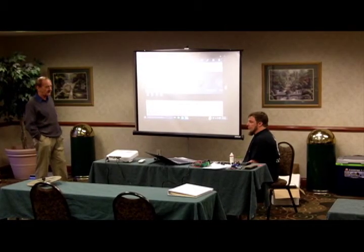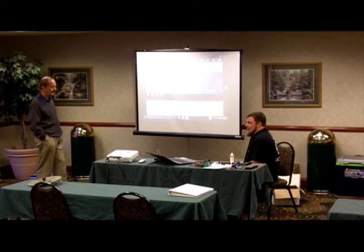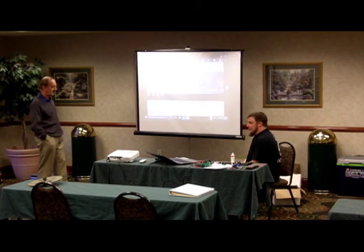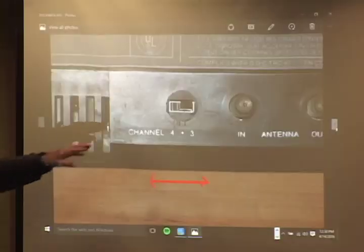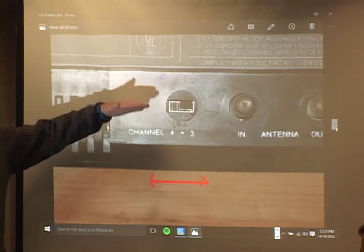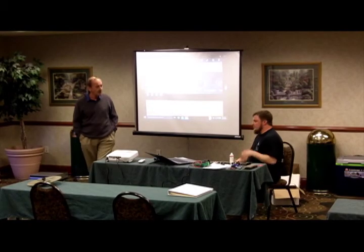Same. Sometimes I fix a player, it worked fine, and all of a sudden it's grainy. I'm like, what? I just sold this. This is terrible. And then I do that, and all of a sudden you're like, oh. Simple fix. If you think it's the problem and it still doesn't fix it, you're going to have to take the board out of the player, unsolder the metal shield on it, and put some contact cleaner directly on it. That's a more difficult job.